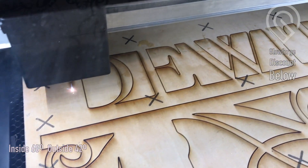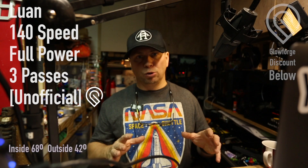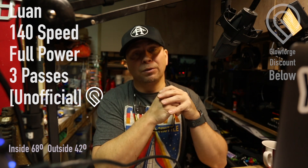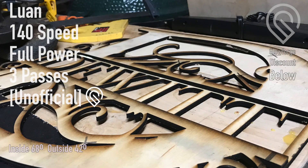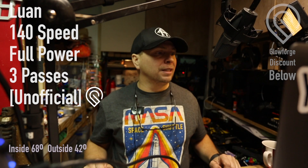I have three files I'm going to be cutting: the top, the middle section, and the insert D which goes in and sits flush. Take your time, have wood filler ready, have some clamps. The big thing is make sure the laser cutter cuts all the way through. The settings are: 140 speed, full power, three passes — this is for 3/16 Luann. Using uncertified or unknown material inside the Glowforge, you should get really good results without needing to cut things out manually.